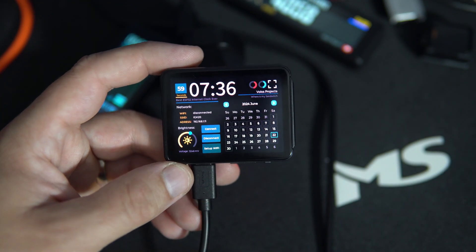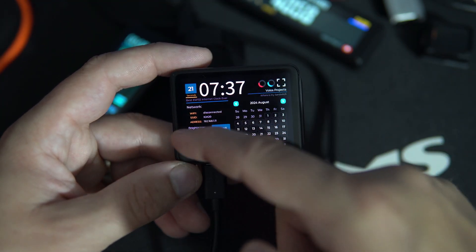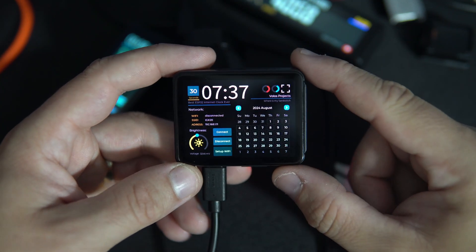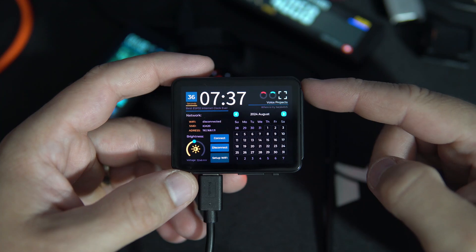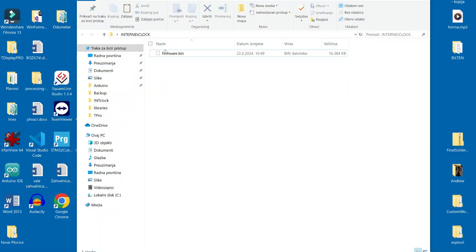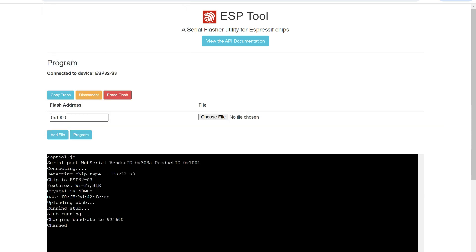Of course I can choose numbers and other non-alphanumeric characters. I also need to set my time zone — remember, that is very important. When I click save, this will be stored in my EEPROM, and I can click connect to set my clock. There is also a calendar and brightness setting. Yes, it is the best ESP32 internet clock ever. So in the description you will find the code as binary files. You will download the bin file, visit the flashing site, connect your board with a USB cable, put flash address 0, choose the bin file you downloaded, and hit program. Very easy — without dealing with libraries, settings, or IDEs.